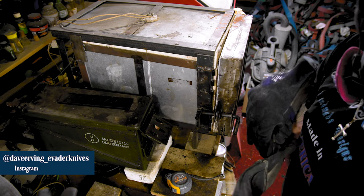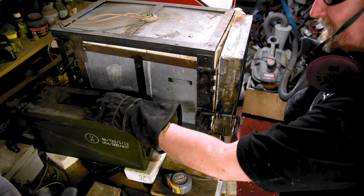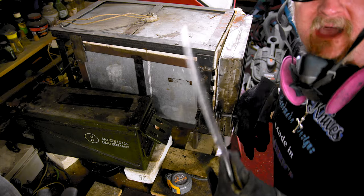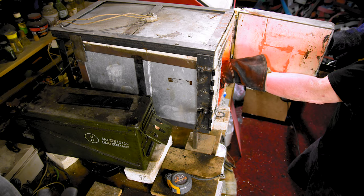Oh yeah, if you watch me on Instagram, you'll see this mount I put up. It's brand new. All right, the oven's at 1500 degrees. I put a new mount on the ceiling for this one. It should capture the quench and everything. It's been at 1500 for 15 minutes, 52100. Woo!